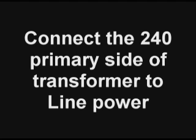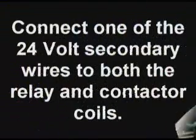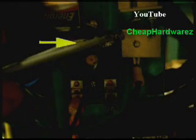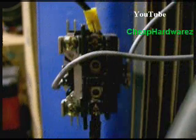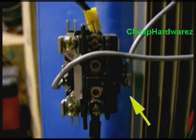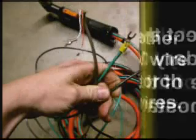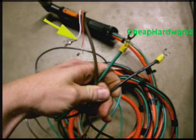Now to wire the control. Connect the 240 volt primary side of the transformer to line power. Here I have a bus connection, so it's easy to just drill and tap in place for a screw to put one of the wire connectors under. Connect one of the 24 volt secondary wires to both the relay and the contactor coils. Connect the other secondary 24 volt wire to one of the torch low voltage — in this case thermostat wire — let's say the white one. Connect it here; that goes to your trigger.